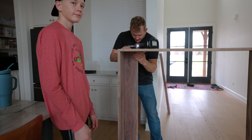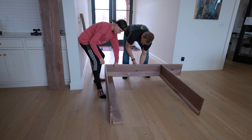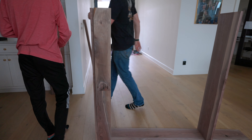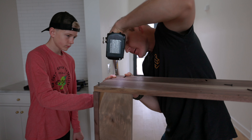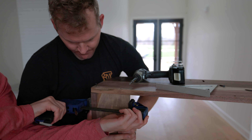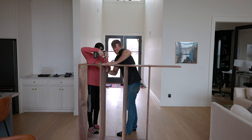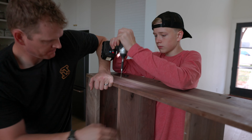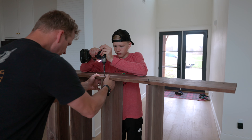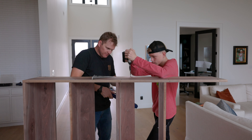Here we're doing a dry fit for the exact reason you do a dry fit. We assembled it and put it into the nook because according to the tape measure it was supposed to fit exactly, but when we actually put it in there it was about a quarter inch too tight on top - walls are never exactly square and perfect. They're generally close, but we had to disassemble it, shave off a quarter inch off each shelf, and then put it back together.